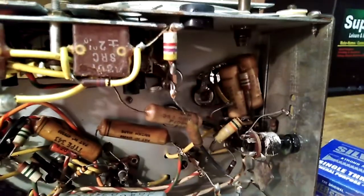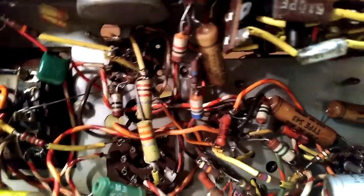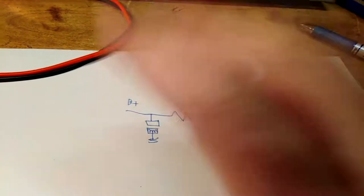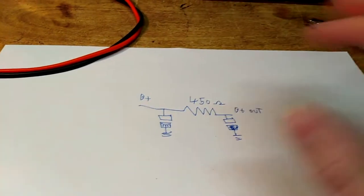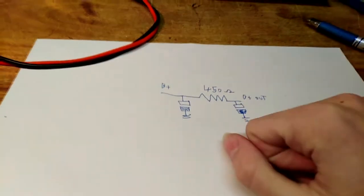This is the aerial jack here where it comes through. You can see the coupling condenser that goes to the tuning circuit. You've got all the oscillator coils — all of them look fine. I did check, and it was oscillating. There was a ton of noise, but there you go. They're using the usual configuration. You've got the B+, it's unfiltered here. It gets filtered by one capacitor, goes through the dampening resistor — which is basically used for filtering out small signals, it just turns them into heat, very inefficient — and then there's another capacitor at the output. This kind of forms an almost pi filter, but they've used a resistor instead of an inductor.